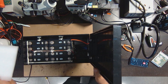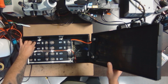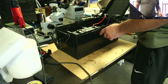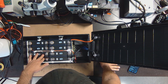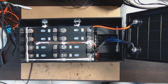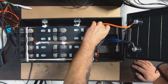It has some trusty foam on top of the cells. And as you can see, we have eight cells right here. My assumption is that these are 100Ah cells wired in parallel, then in series. You can see they are in parallel here. Let me bring the camera lower so you can see inside the battery better. It also has a BMS on the side.